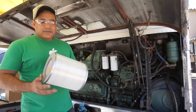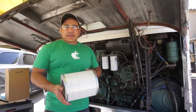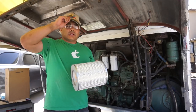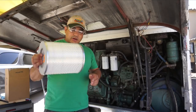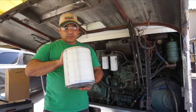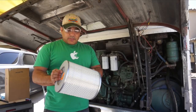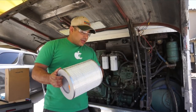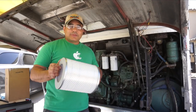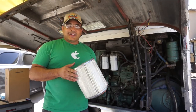Next we're going to tackle the air filters. Ours does not have the oil bath filters — it was modified at some point. The ones it takes are Napa 6343s, just a paper element. We got four of these at the Napa store. They go way up inside, so we'll be installing these and see if that helps with our engine problems.